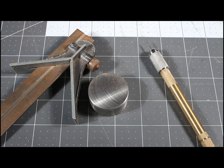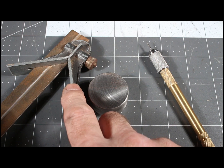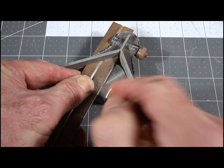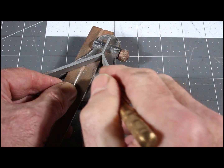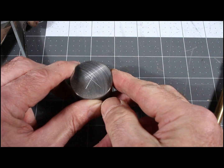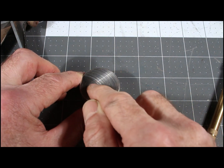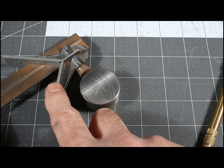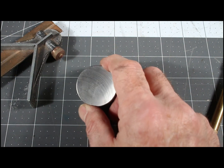Another option for larger cylinders is to use your trusty old tri-square. This is part of a woodworking square system. You just line it up and make multiple marks — one like this, then turn and go like this, and a few more. They're all lining up perfectly, as they should. Sometimes if you're not perfectly round, these marks will form a little gap in the middle between all the lines. There is a smaller version specifically more for machine tools, so I'll link to that below.